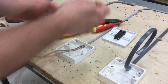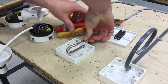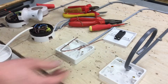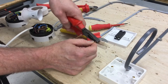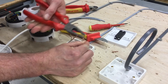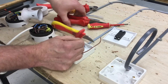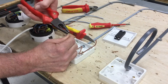Conductor length: I like them to be about 50 to 70mm longer than the box. Folding back over on itself, make a cut so all conductors are the same length and at least 50 to 70mm longer than the box. To terminate the ends, about 20mm down, press harder with the knife and score all the way around. Take a pair of pliers to remove the insulation — slightly less than half into the pliers, fold it over, and squeeze up the gap so it's doubled back on itself.